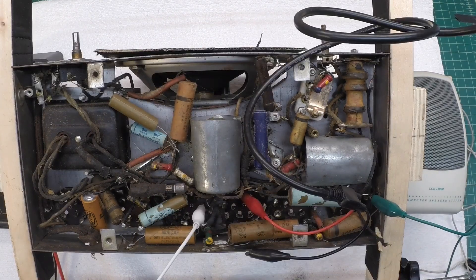Giving transformer number two a test — I don't like what I hear on the signal tracer. I'm rocking the dial and there's no resonance at 485 kilocycles. It's kind of a broad response. We'll know more when I check DC resistance.